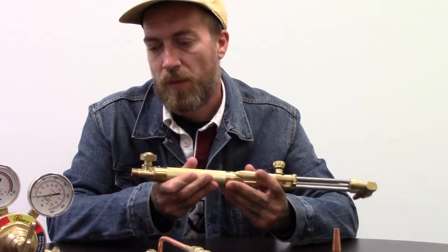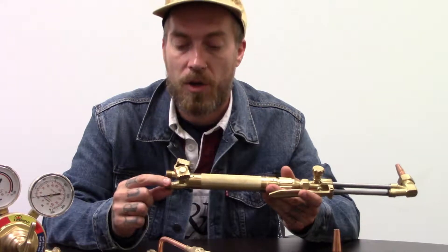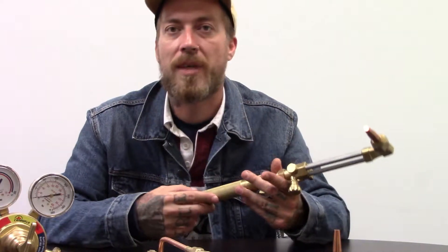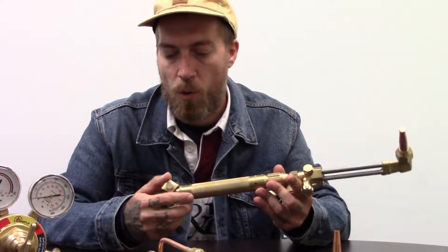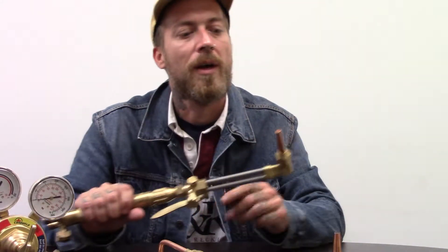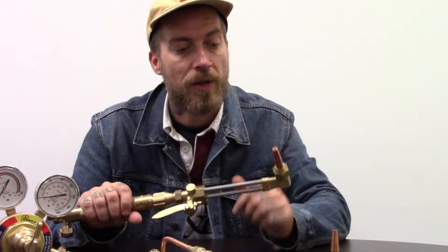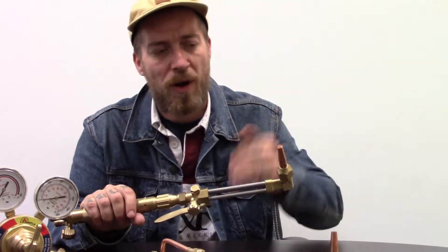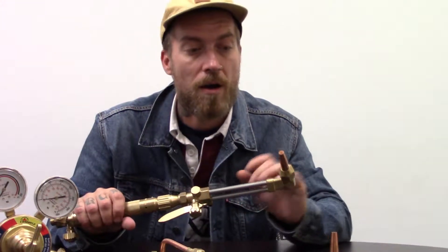Now that it's all together — this side is labeled oxygen, this side is labeled gas, so make sure you hook up your acetylene to the gas side and your oxygen to the oxygen side. When you're ready to start cutting, crack this valve just a little bit — a quarter turn — until you can smell a little bit of acetylene coming out. Use your striker or lighter to light it up and you'll have an orange flame. Then crack the oxygen just a little bit — if you crack it hard you'll blow it out — ease into it, and you'll see the flame turn into a bright blue cone with a brighter blue feathery tip on the inside. Keep turning it up little by little until you have a hot enough, big enough flame for your cutting.